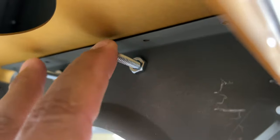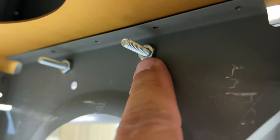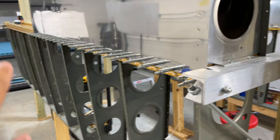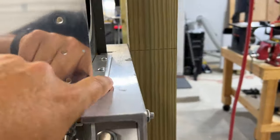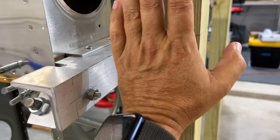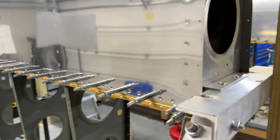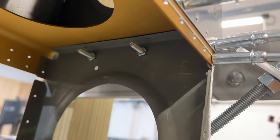If you're making these brackets, you might want to think about where these are positioned - maybe set them a little bit further out. All I have to do is remove this and flip it around, because this thing is supported at both ends. If I take one bolt out completely to work on that rivet, it doesn't want to twist - it still stays flat. I was worried that if I took a bolt out the wing would want to rotate and pivot on the other point, but it doesn't because it's being held square up there. Save yourself some headache and have these things out of the way to begin with.